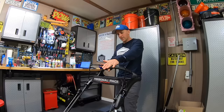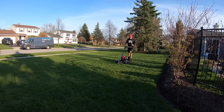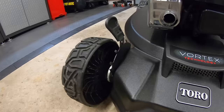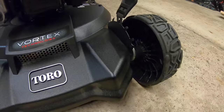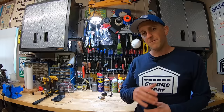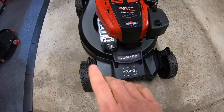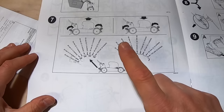The personal pace feature on this mower is very fast. You can control your speed nicely with this drive system — the faster you walk, the faster it'll go. What was nice to see is that this mower still cut well even at higher speeds. The larger back wheels make this unit easier to push and easier to steer. Height adjusters on each individual wheel are simple and effective as they've always been. Many new mowers have a gizmo for one-touch height adjustment, but they don't always hold their height so well. This old-style method of individual height adjusters on each wheel is tried and true, going all the way down to one inch and all the way up to four inches.